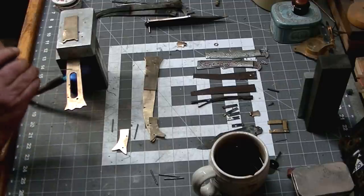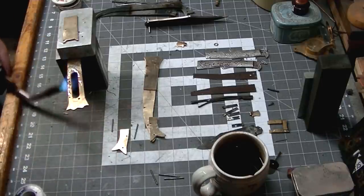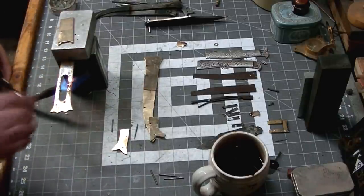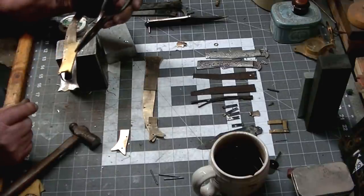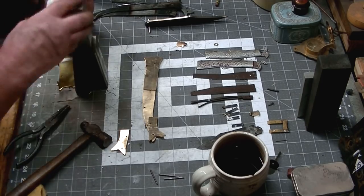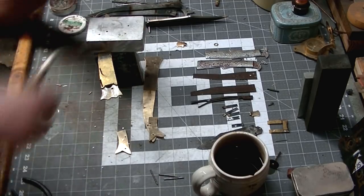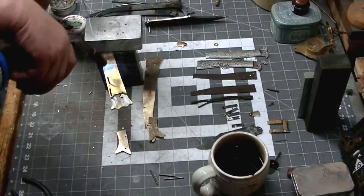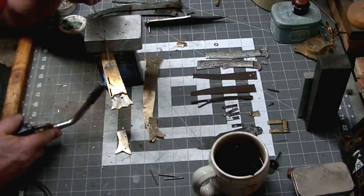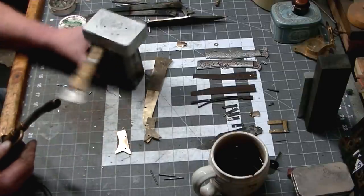So we'll take all of our pieces, and we're going to tin this bronze by getting a little flux on it and some solder. And wipe that off, and that'll tin that very nicely. And we'll lay our pieces together, some alignment pins to keep everything straight. And we'll go ahead and flow some solder in there. Are you plumbers out there, we'll sweat the solder in. I like that. It'll tend to follow the heat, so as we introduce it to the edges, it'll work its way towards the center. But with both pieces tinned like that, they should solder together fully anyway.